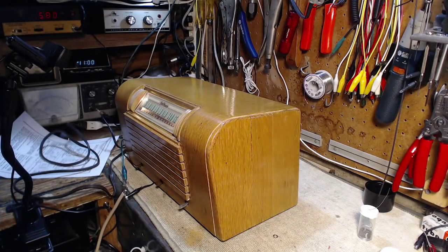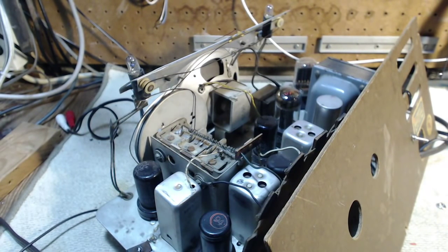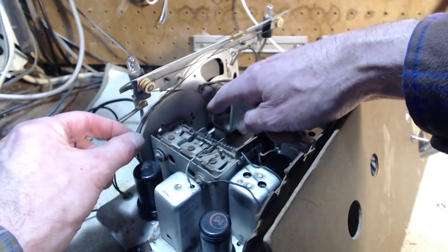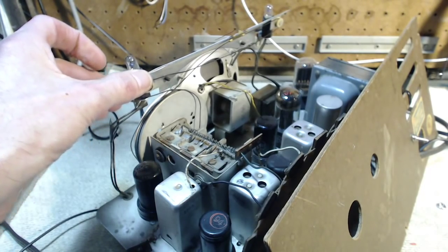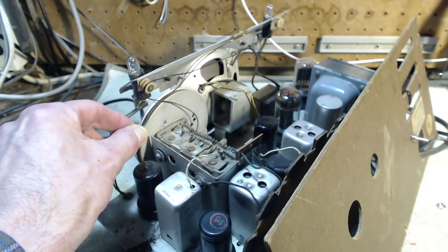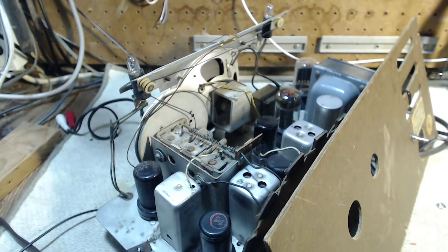I can't stand the suspense — I've got to pull the radio out and see what's actually happened in there. So the string is not broken, it's simply dismounted from the big wheel. In some ways that's almost more disturbing, because the dismounting is usually caused by some kind of misalignment of the pulleys, and sometimes we're talking about fractional amounts. The capacitor wiggles around. The wheel is nice and solid, not wobbly or off kilter. But I'm not going to deal with it right now — that's going to be the topic in the next video, because apparently there's always another video. Thanks a lot for watching, and I'll see you soon.